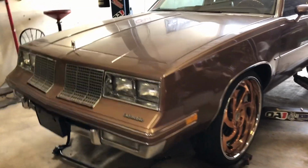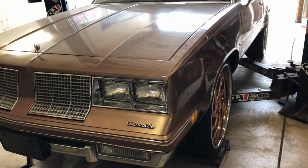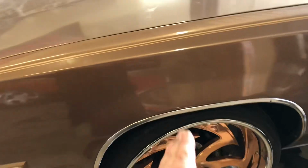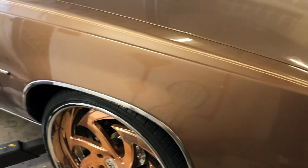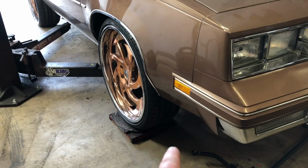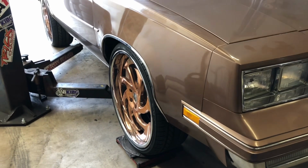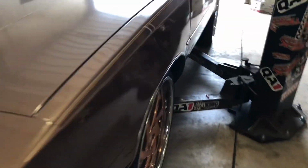On the shims on the top, I did end up on this side, I put 2 shims, what are they, 1/8 inch. So 2 of them, 1/4 inch, on the back upper control arm bolt, which pulled the wheel in and back. The wheel is straight up and down. It's got a little bit of negative camber, which is fine. This side, I thought I was gonna have to go with 1 shim and 1 shim. I ended up actually having to go 2 shims in the back and 3 shims in the front, which set the spindle height from the ground or from the plate up to the bottom of the tie rod spot on the spindle. I know there's more to it than that, but anyways. Both sides measure the same height in the front. So now I can put the sway bar on.